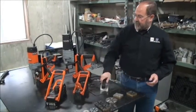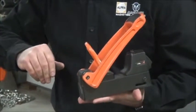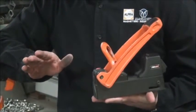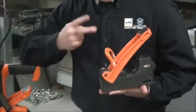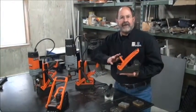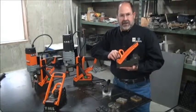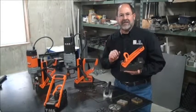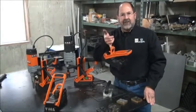It does have a bigger brother — the TML 250. These are rated in kilograms; that's about 550 pounds of safe working load. We always rate our magnets at 3 to 1. Do not be confused by safe working load of some competitive magnets that might rate theirs at 2 to 1 — that's just an artificially inflated number. So at 3 to 1, 550 pounds means this magnet has an ultimate breakaway of about 1,700 pounds. The really incredible thing is it does that even on quarter-inch steel, and at 3/8 inch steel you get full power. And it weighs in at a whopping 8 pounds — that's a huge advantage.